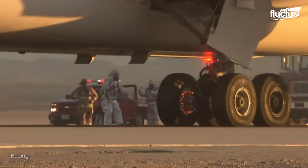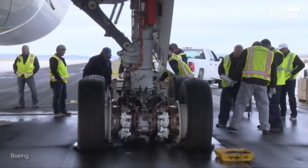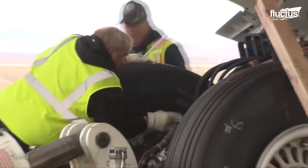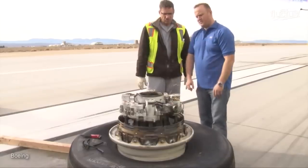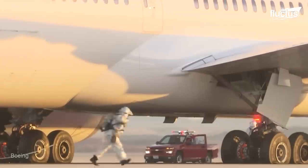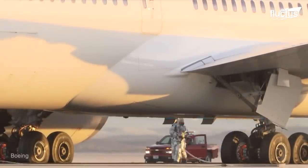During aircraft pre-testing for companies like Boeing, the role of this device and its functioning are strictly monitored. We are monitoring the wheels — the tires themselves deflate per design. They have devices called fuse plugs within the wheels themselves that melt under high temperature and then in a very controlled fashion release the pressure of the air or nitrogen in the tire so they don't blow treads.